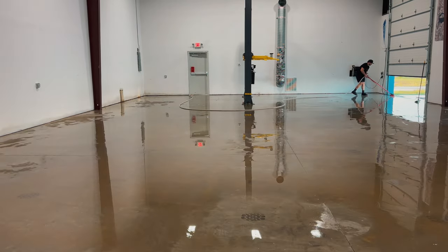I highly encourage you to check them out if you're considering doing an epoxy floor in your garage or shop. They have several different color options with specs too. Let's take a look at the finished product. This is after a few weeks of me being in here actually working — so it's dirty, there's trash, debris, and dirt; I've been taking apart some trucks. But overall it just kind of wipes up and cleans really easily. You can see the floor as I'm walking around on it — from the last portion of the video it was really glossy. You can kind of see there are some specks in it — that's the anti-skid additive. I took out about half of what was recommended so I could have a higher gloss.